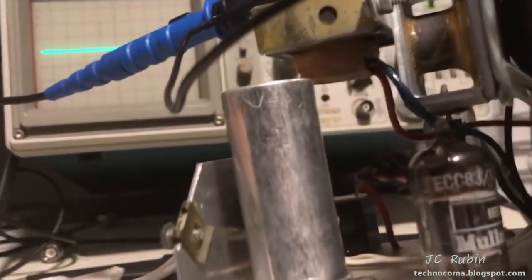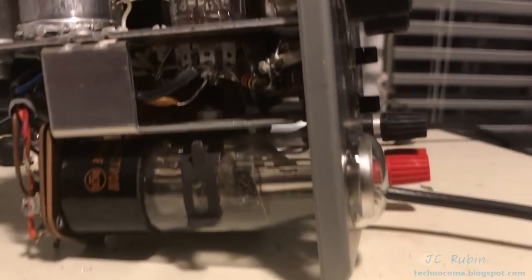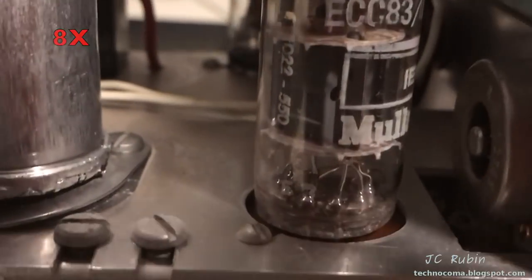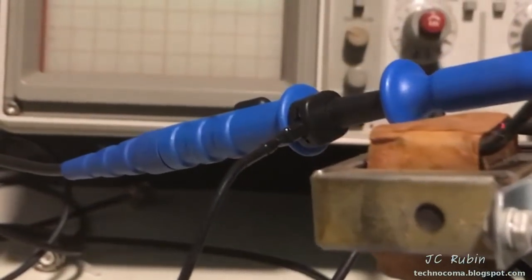The unit power is on, and we're going to start dialing it up. We're sitting at 50 volts. We're taking a look. No smoke. Volts. I could start to hear something coming from the speaker, and we see some emanation from the magic eye. That's good. So we're going to stop it here at 80 volts.